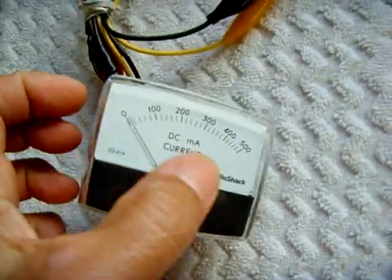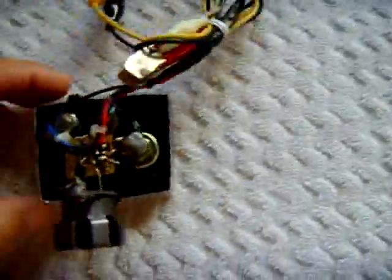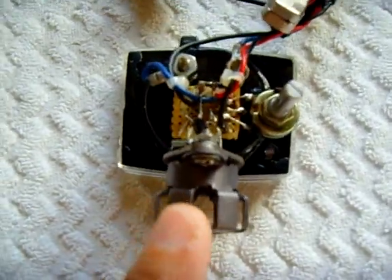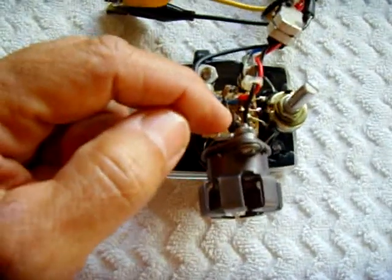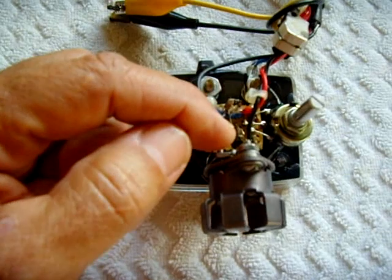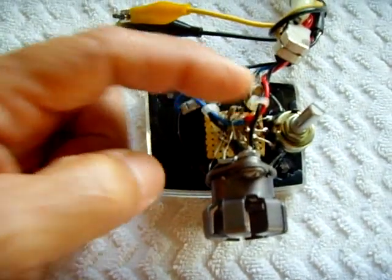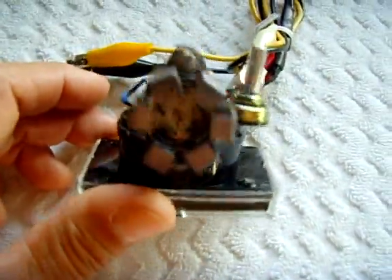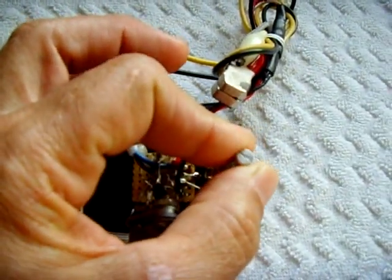You can turn this anywhere from just a few milliamps all the way up to 500 milliamps — half an amp. I just glued the circuit on the back. It has a 2N3055, that's where all the current flows through to go to the battery being charged. There's also a 2N3904 transistor, and a resistor which goes to the base. It's a very simple circuit — I'm going to post a link in the description box. And I put this 100 ohm rheostat, or potentiometer, right here.